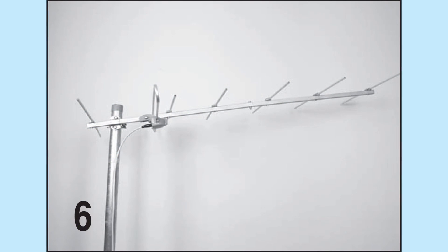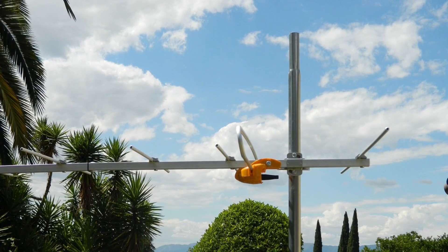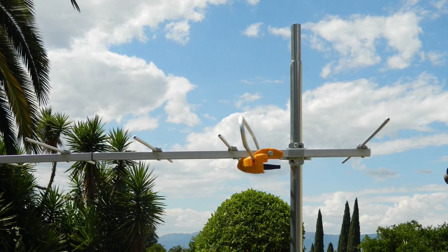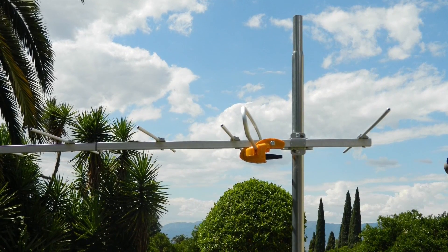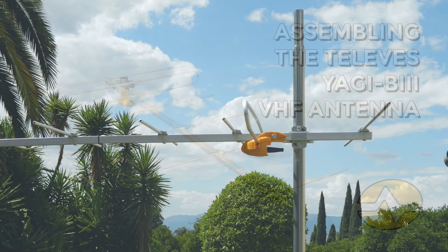In their final picture they show the antenna not quite being level, and I don't quite understand why. This is what the antenna looks like when it's level. You do need to connect an antenna cable to it — it comes with a screw-on F connector, or you can use your own cable with a connector already attached. It comes with a weather boot, but it does not come with what you'll need for grounding. Remember, observe all grounding ordinances.